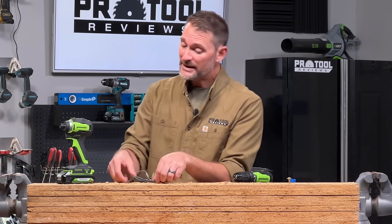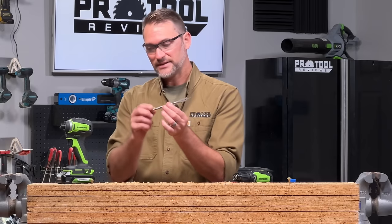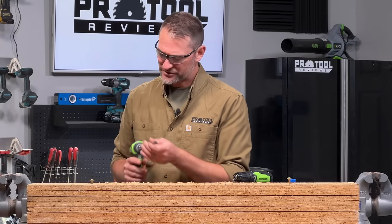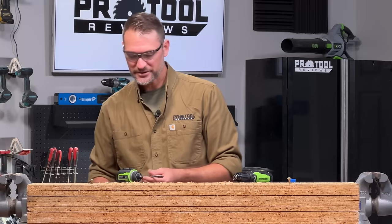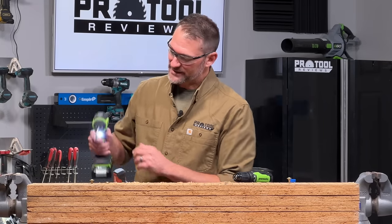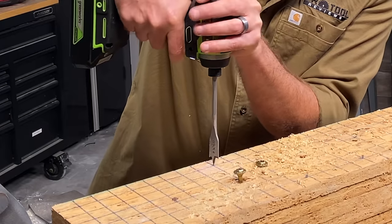Can you do more? Yes, depending on how much power and speed your impact driver has. They even have spade bits with that same quarter-inch hex shank. This is a 5/8-inch spade bit and this is OSB — it's kind of tough, we glued it together and screwed it together. This is probably really pushing what we should be doing with an impact driver, but we can find out.